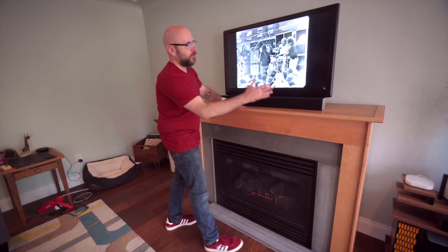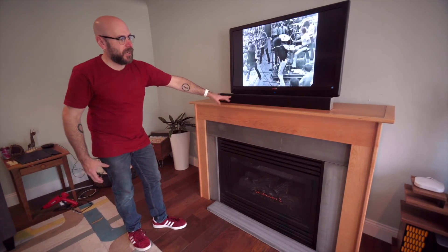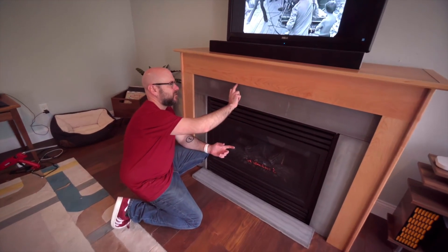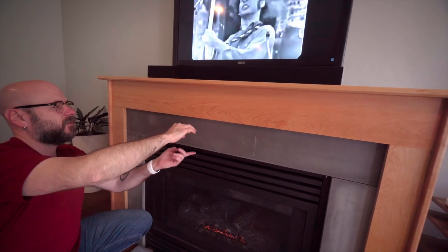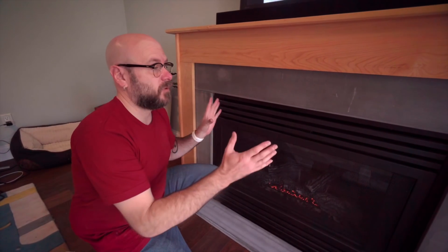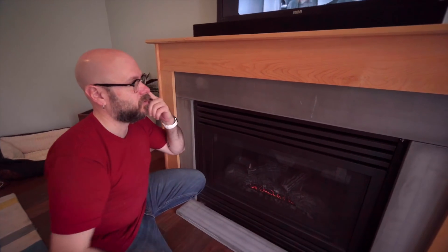It's super heavy. I was able to lower the TV a little bit — I don't like it up super high — but I couldn't go lower because I needed six inches of clearance between the fireplace and combustibles, and I think 12 inches from the top to the ledge. Every fireplace is different, so you have to look at the specs for your particular fireplace. Some gas fireplaces don't require any non-combustible, so you can build right up to it.